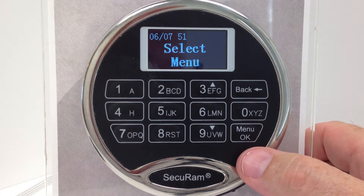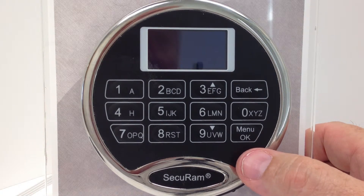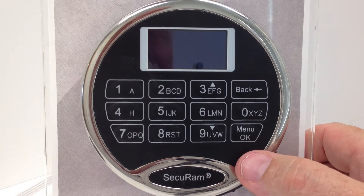So that's how you identify what type of ProLogic system you have. The most important information is the last three digits of the system menu where it says L followed by two digits — so it's L66, L22, L62, or L68. Once you know that, you know what type of system you're working with and you can program accordingly.